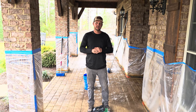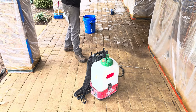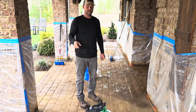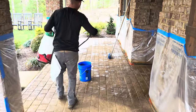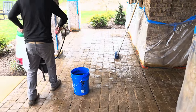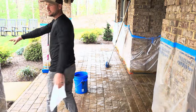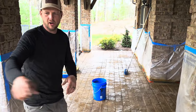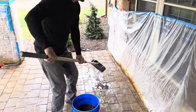Our acetone dye is now dry, so we've got to put our liquid antiquing down on top. We love this tool right here — this is a Milwaukee backpack sprayer. We just pre-dampen the surface so that stuff glides and moves around a little bit easier. You definitely want to dampen your surface if you're doing this in the heat of the sun — you will 100% get brush marks. So always just pre-dampen it; it helps it slide around. You can see some spots are drying a little bit, so I'm going to go spray a little more. Remember, you're always keeping an exit strategy in mind. The sidewalk has its acetone dye down — you can see the color looks really nice. We're going to work our way straight back off the edge, and our other two stamp jobs are over there behind us.